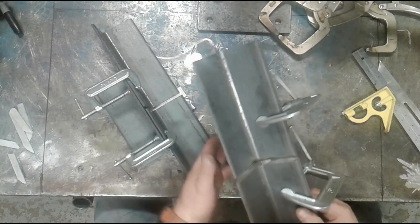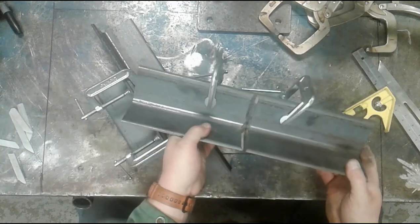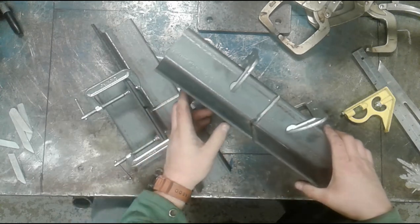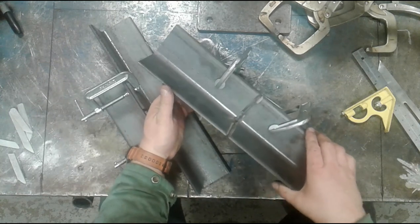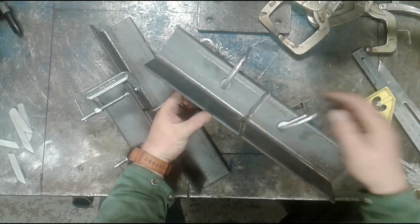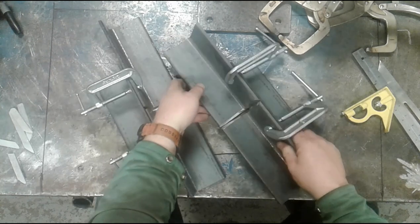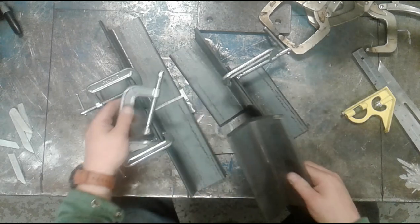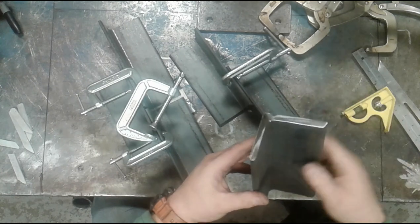Eventually, you're going to need to lengthen a piece of angle bar. I think it's really important that you do so maintaining the original strength of the material. And I've got two different setups here. The first, which is probably the more common, is to bevel the angles. I simply took a grinder and I beveled these. I'm going to pop this off so we can get a view of it. But essentially, the bevel goes all the way into the corner.